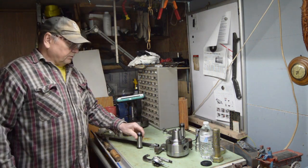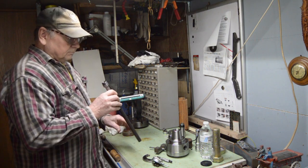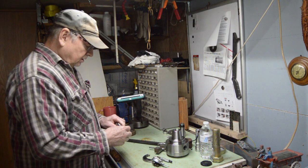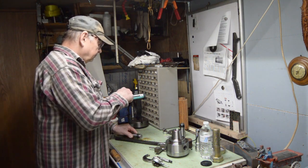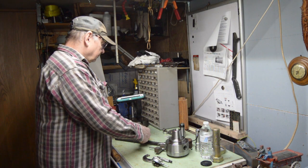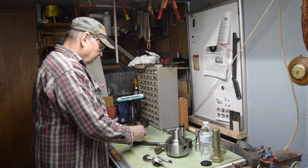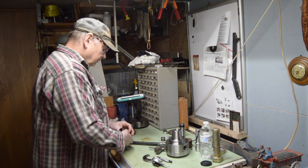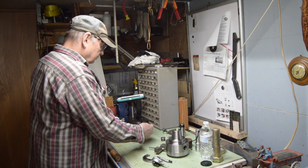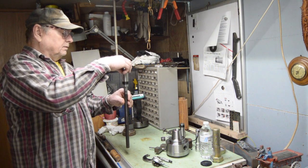Yesterday I started working and made this part here. It's a hollow tube with a fitting on it. It fits into the back of a 5C collet - it just screws out of there. This is for a stop. I made this up; it's got 24 threads and the diameter is 1 inch 042. This just screws into the back of the collet.